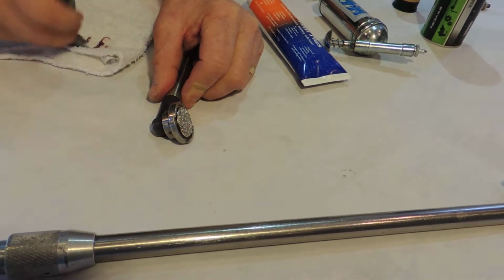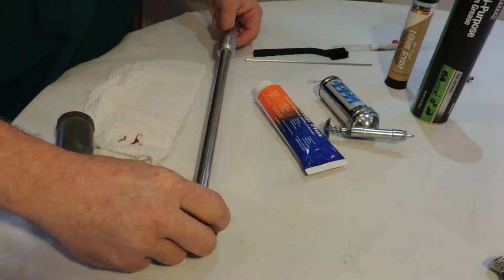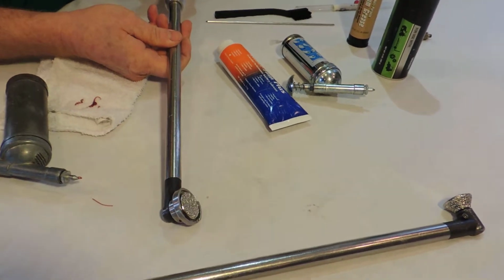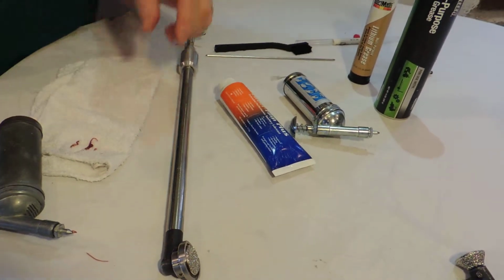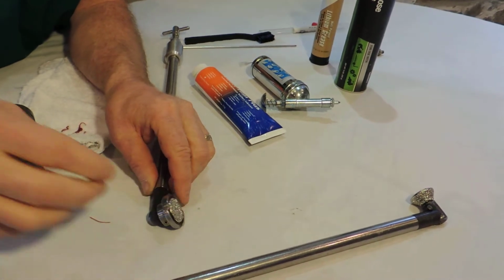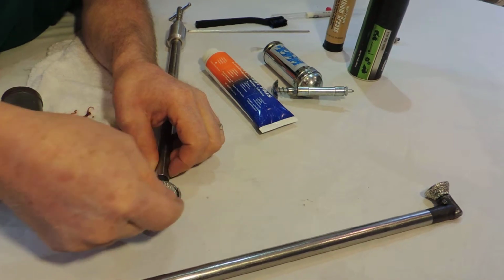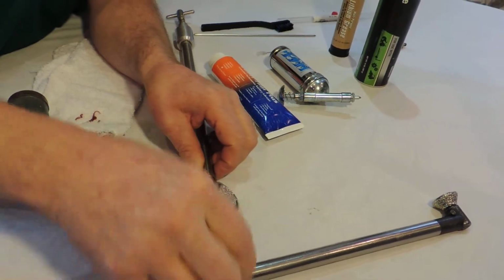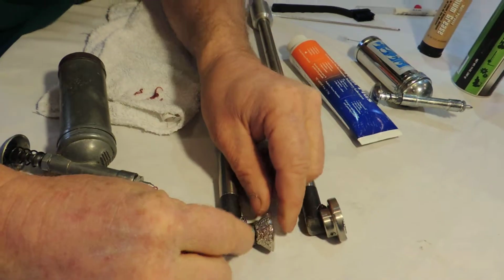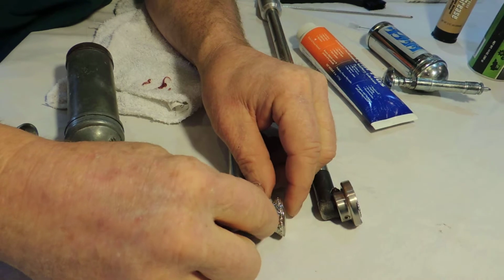Another trick for this is that as you put it in, you can spin it a little bit, either with your finger or using your T-wrench back here. You can actually spin it a little bit as you pump the grease in. As you pump the grease in, you might notice that the disc actually becomes a little bit harder to turn. That's a good sign. Or you might notice that grease is coming out underneath the disc around your guard. If you're using the buckle burr or apple core, what you'll notice is that grease may come out right here. This is also a good sign that the grease is flowing through the system.